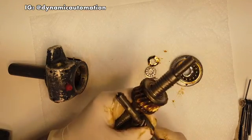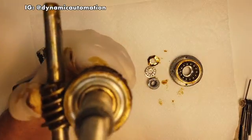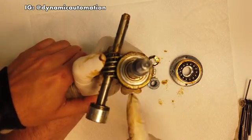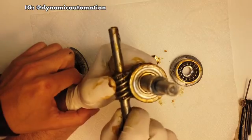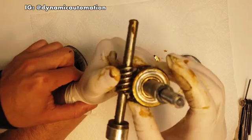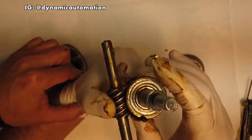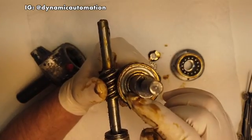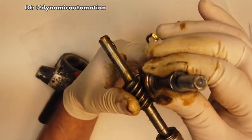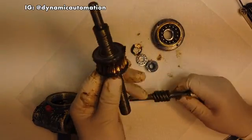I put this worm in — the axis of the worm will be perpendicular to the axis of the shaft. So by rotating this worm, the worm gear will rotate. When the worm is rotating like this, it will rotate the screw, and the screw goes up and down by holding on the screw itself.